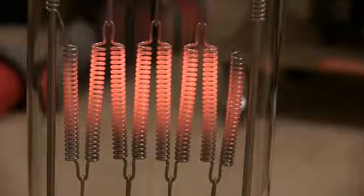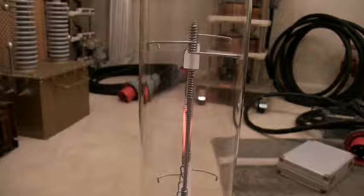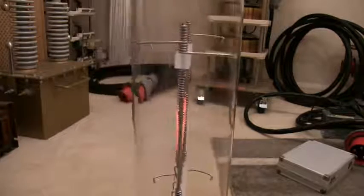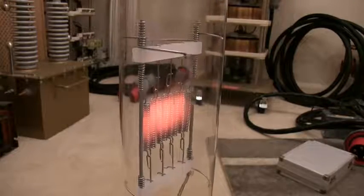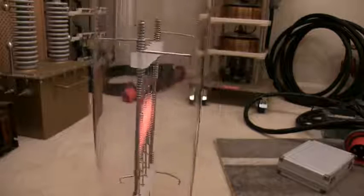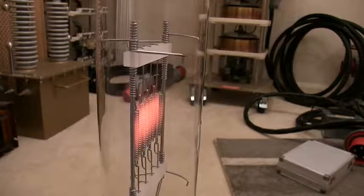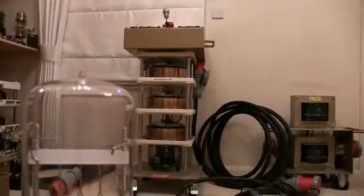The heat's rising slightly. The burning positions on these are vertical plus or minus 45 degrees, so it needs to be vertical 45 degrees or less — that way or that way. It can operate vertically but I'm going to avoid that because there's going to be a lot of heat right at the top. So the best position I think would be like this, so we don't get all that intense heat building up on the top.